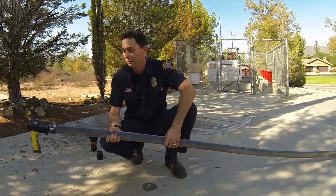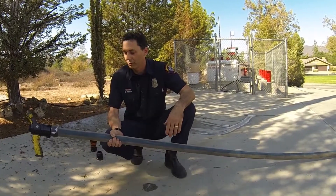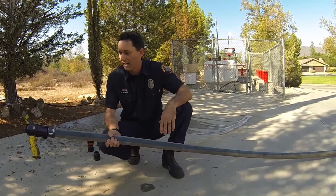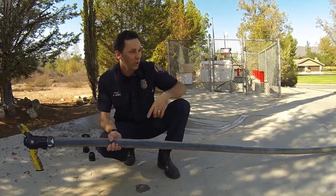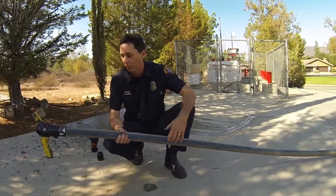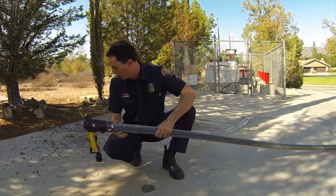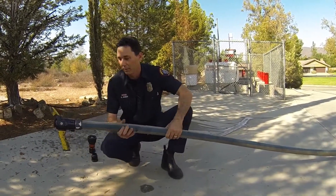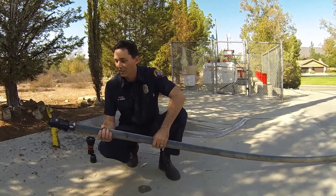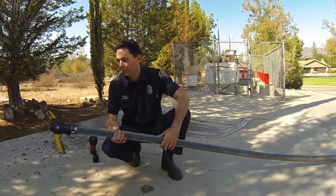The way CAFS works — it's really important to understand. At the pump panel, foam is injected in through the Husky foam system at 0.3% — typical Class A foam like Silv-ex or other major brands. Water pressure is always pumped at 100 psi, and we've got air pressure to match that. Importantly, you have to have a minimum amount of hose. We use inch-and-a-half hose — the longer the hose or the smaller the diameter, the more mixing we get, which produces better foam. If water, air, and foam aren't mixing properly, you'll get pure air coming out of the nozzle — we call it 'chug,' where it kicks back on you. If that keeps happening, increase mixing by using smaller diameter hose, a longer lay, or as a last resort, bump up the foam concentration to 0.4 or 0.5%. If that doesn't fix it, another part of the system isn't working right.